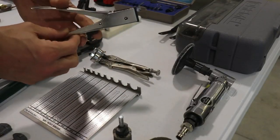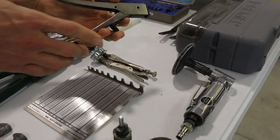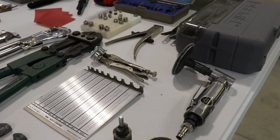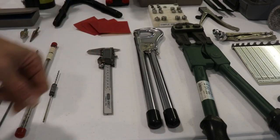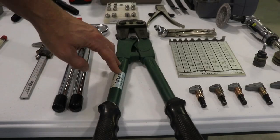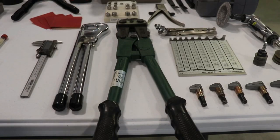This tool is a nibbler — it takes a sheet of aluminum and just takes out a little nibble. I used this to build my entire instrument panel to cut big square holes, so it's nice to have. It might also be nice to have a pair of digital calipers. And you will need one of these big crimping tools — I bought mine used at a yard sale — it's used to crimp the flight control cables.